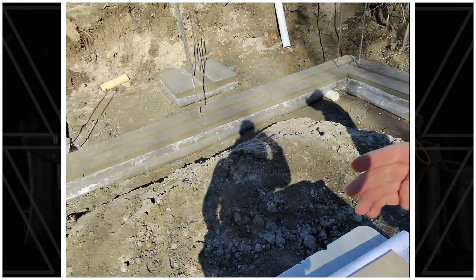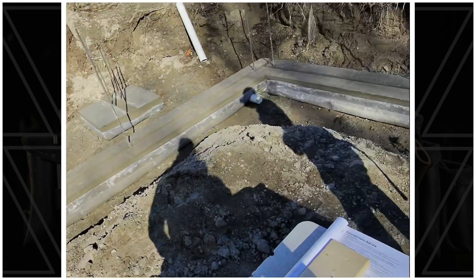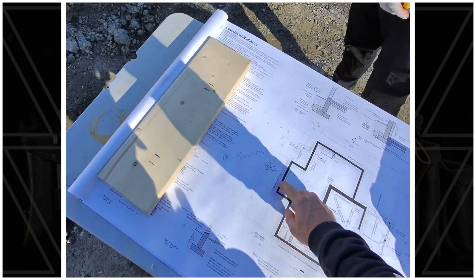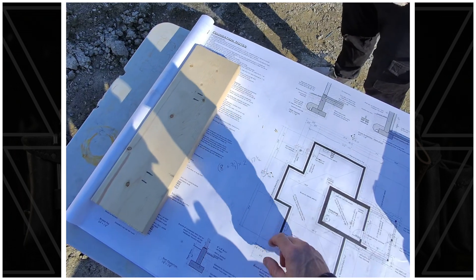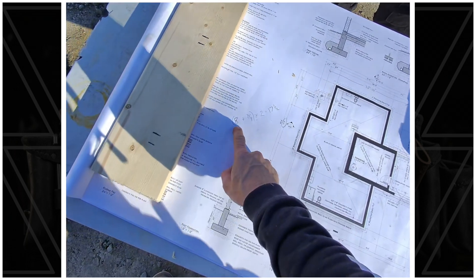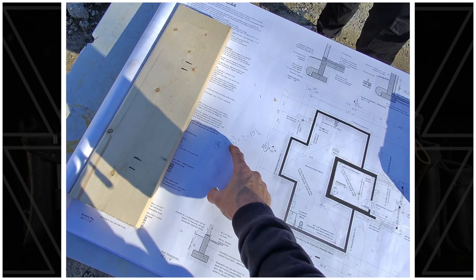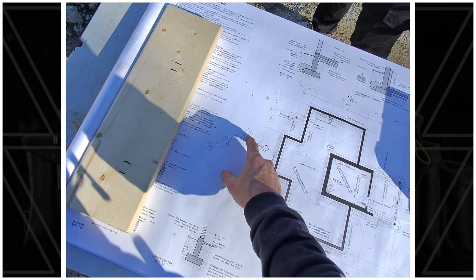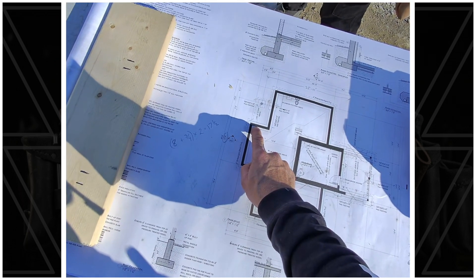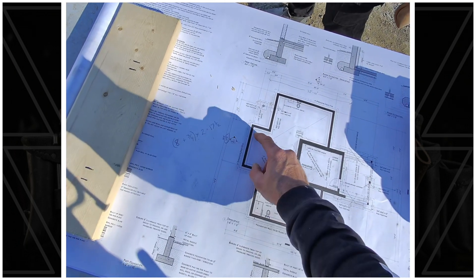We are forming up the inside formwork first, because we have to put a corbel around this entire thing, so we are doing the plates around the inside of the foundation. In order to use the outside dimensions, I'm going to have Josh hang his tape over my lines. What I need is wall thickness plus form ply: 8 and 3 quarters is one total wall thickness, times 2 is 17 and a half. That way I can have Josh hold his tape 17 and a half inches over this line, and then I can mark 14 feet — that will give me my inside to inside.